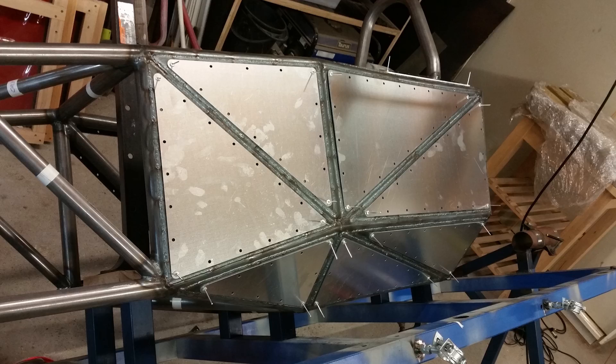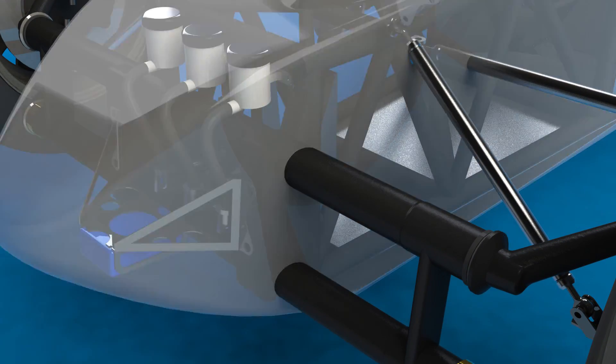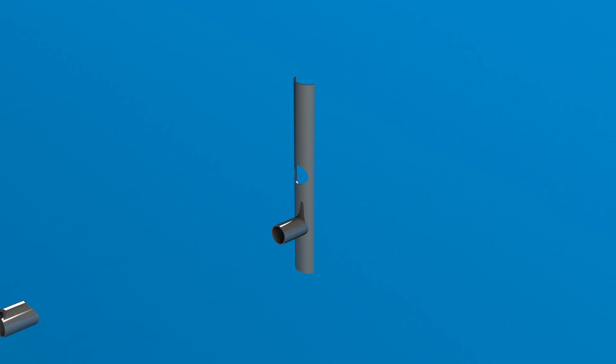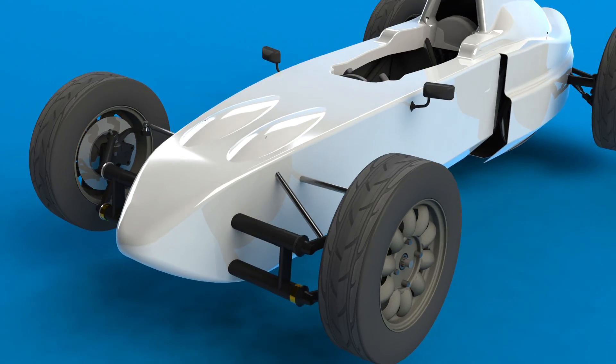I did a quick test to make sure that everything went together okay. Next up were the mounts for the front suspension. This was necessary to distribute the force from the suspension H-beam into the chassis. Without it the chassis would be crushed by the H-beam tubes just from tightening the bolts up. It also serves as a small expendable crumple zone which will hopefully protect the chassis if I were to have an accident.